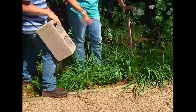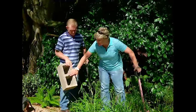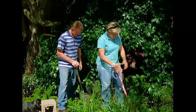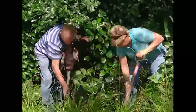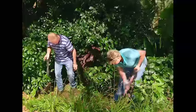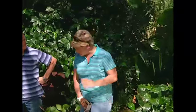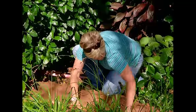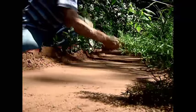First we need to create a level platform within the garden. We're not going to be taking out the border plants — border plants are really important, especially when you're using any hard concrete or building materials. We want to clear out a little area that's going to be the base of our platform: 500 wide and 2 metres in length. Get some river sand, lay that down, and use a spirit level to get the levels right — because when you're using anything solid, like a paver or a concrete block, your levels always have to be perfect. Use a wooden float to tap the river sand down nice and firm.